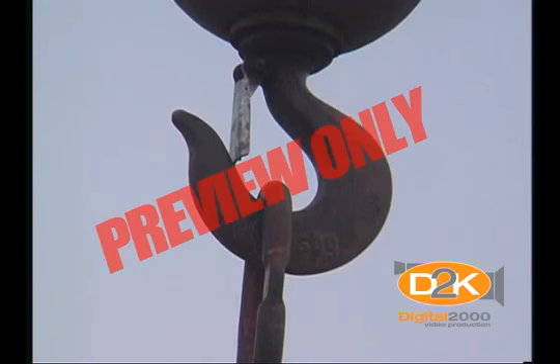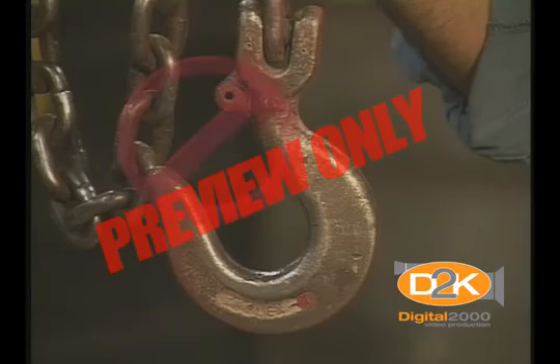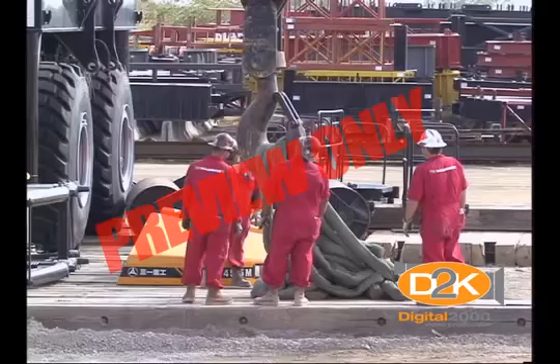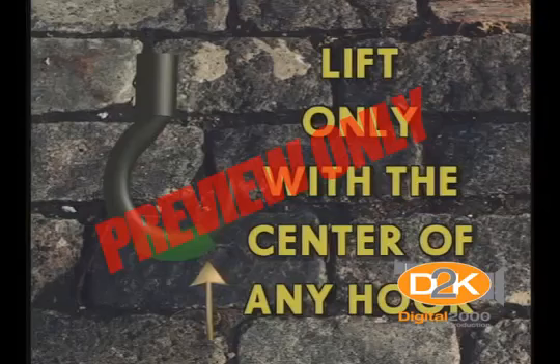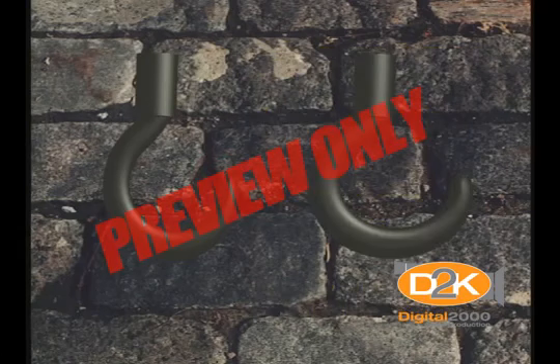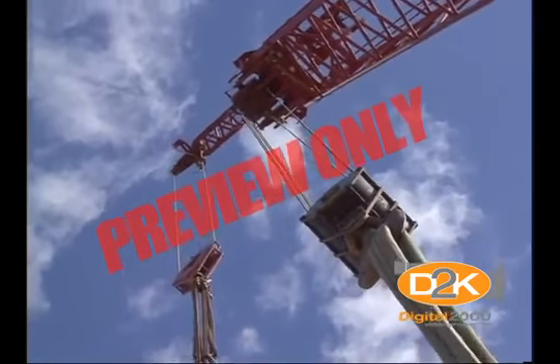Part of your equipment includes hooks. This type of hook must have a safety latch to keep your sling from slipping off. Generally, all crane hooks must have safety latches. If the latch is broken or bent, have it repaired or replaced. Another hook type doesn't require a safety latch because it connects directly to the material being elevated — these are generally used in foundries or heavy manufacturing. Lift your load in the center of the hook, as hooks are designed to take the load only at the center. Lifting on the tip of any hook is unsafe — it stretches and weakens the hook. When a hook is stretched more than 15% of its original size, it's unsafe to use and should be taken out of service.